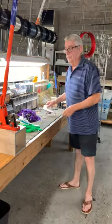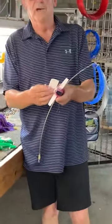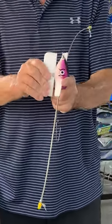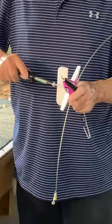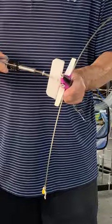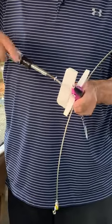With ours, it's quite a bit different in that you can fix it right on the boat. As you can see, it's bent from somebody stepping on it. You're going to bend it back as straight as you possibly can, just like that. Then you're going to take a standard Phillips head screwdriver and back out that screw. You can see it wobbling because it's bent — that's all the problem is with this bar, the fact that it was stepped on and the screw was bent.